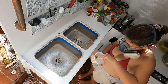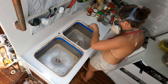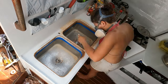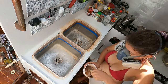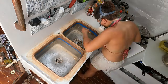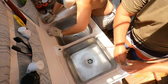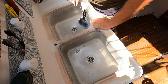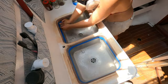I applied a layer of thickened epoxy to the areas that needed to be built up a bit. Next, two layers of fiberglass and epoxy to seal the deal. And now, because we do not have access to shore power, a bit of hand sanding to prep for the two-part paint. I taped it all off again and cleaned with acetone so that the surfaces were perfectly clear of dust and oil and ready to receive the paint.